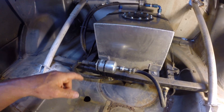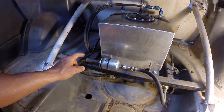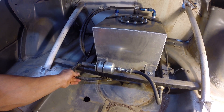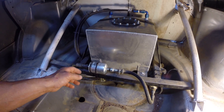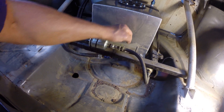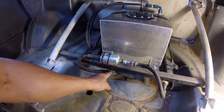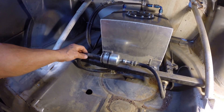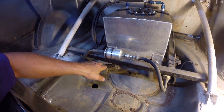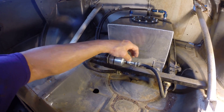Since we're on a tight budget — this is a Cavalier — if you go to the salvage yard you'll find old fuel rails. These are actually the feed line and return line from an old fuel rail; I just snipped those off. I used fuel injection clamps — the high-pressure type that fully encircle the hose — and double-clamped everything to keep it safe. Rather than buy expensive specialty hose by the foot and add fittings anyway, the factory lines already come with the fitting built in.